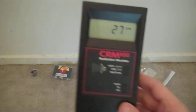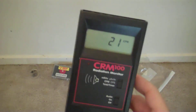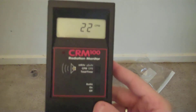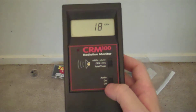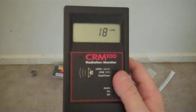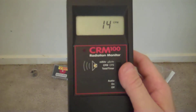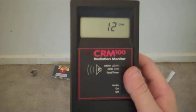The unit is capable of detecting alpha, beta, gamma, and x-rays through the thin window. Its sensitivity is rated as 1,000 counts per minute per milliroentgen per hour, and of course it has a calibrated sensitivity. It has no alert feature whatsoever — this is how it differs from the RadAlert 100, which actually has an adjustable alert feature. Its readable ranges are 0.001 to 110 mR/hr, 0 to 350,000 counts per minute, 0 to 3,500 counts per second, or 0.01 to 1,100 microsieverts per hour.